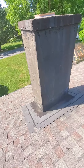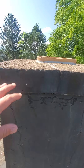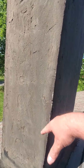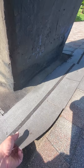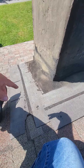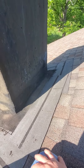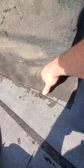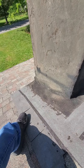The big issue is this chimney. The top is starting to crack. Somebody's already caulked some of it, but the top could really use a good elastomeric coating — some rubber. Somebody has coated the entire chimney in roofing cement, and then they put shingles up here upside down, which I've never seen before. They're really not doing a whole lot — you can see water can go right underneath them. This chimney really needs to be flashed properly, with counter flashing all the way around. The fact that they have probably three inches of roofing cement is going to be a big pain, because that's got to come off. Basically all this roofing cement around it has to be removed.